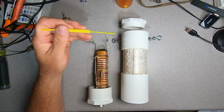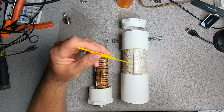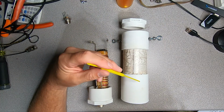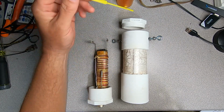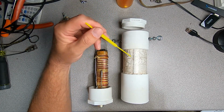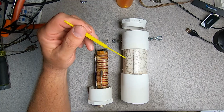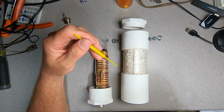Here's how I went at rehousing the balun. I reused what was left of the original housing and set the length of the unions to allow the balun to reside as shown within the housing. The short cap is just going to cap the top of the balun after providing enough backfill of foam to just allow positive retention of the transformer within this new housing.